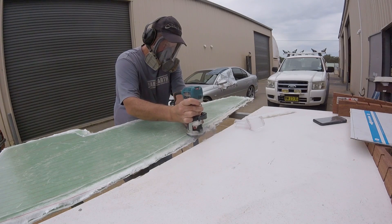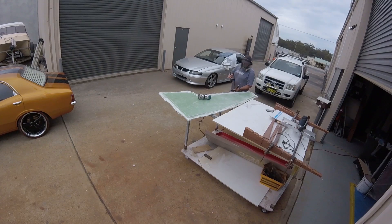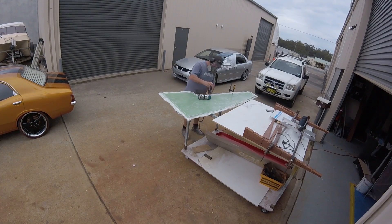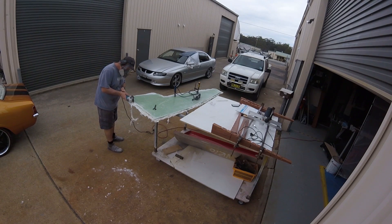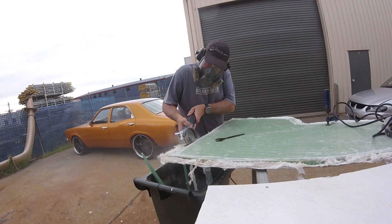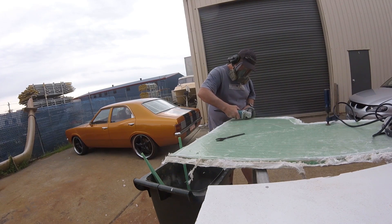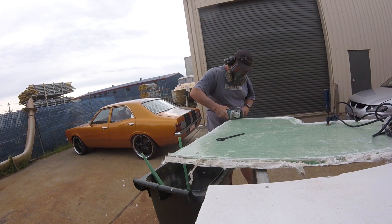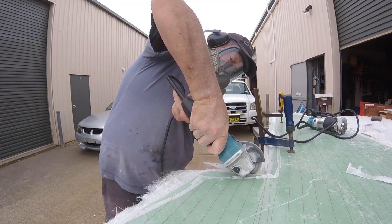After all the things I've used, every tool in the book, I simply haven't come up with a better solution than a grinder with a diamond wheel. And then, as if in doubt, get your flap disc out for the tidy up. That's the process I've had to use for the entire bulkheading and all these wing frame cutouts - the grinder and then the flap disc. I've had some pretty good results - you can get a lot of accuracy and it's quick. The only thing I'll say is because it was a stinking hot day, I forgot to put my suit on and I itched like a bastard for about a week after that. Anyway, job got done and I've moved on.